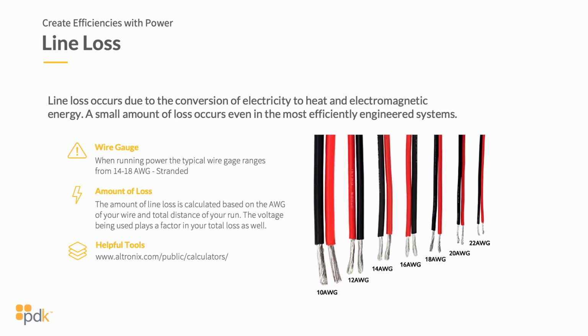So as you or the sales team or whoever it might be is doing the system walkthrough of the building, we want to make sure that as they go through, they're looking at those strikes, determining whether they're field selectable, finding out the power supplies that are already in place, and determining how you can power that equipment and the equipment that you're going to be adding as well. Okay? So now let's look at the different gauges of wire. We're going to have a session on wire and wiring, but I really wanted to illustrate the different gauges of wire because it plays such a substantial piece in powering equipment.